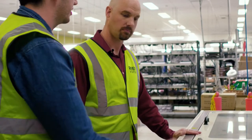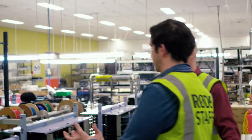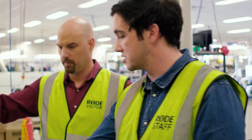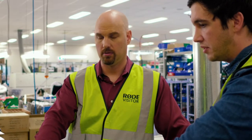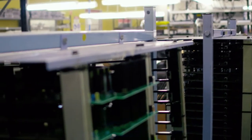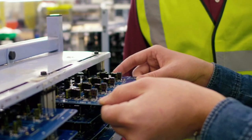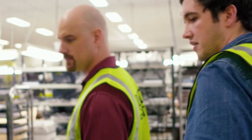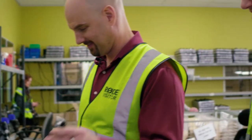In one go you've got a perfectly soldered board, versus having individual manual labor doing each one with a higher chance of dry solder joints. The same principle applies here — you only heat up to the temperature of the lowest melting point component. There's more hand labor in this process since somebody has to place every component in the correct orientation. This particular board is a power supply for a valve mic like the NTK or K2. Over here you'll see a Podcaster — a USB mic — with rotary knobs for volume control and things like that.